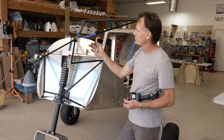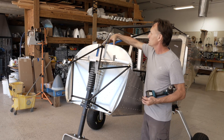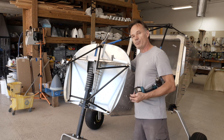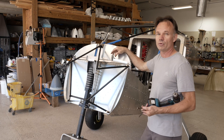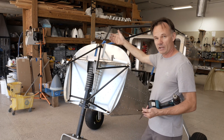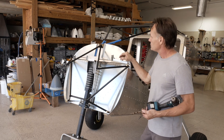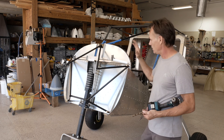Right now we just want to get all four, five, six bolts in there. Up on the top we have a handy welder's type clamp that fits nicely here so you can clamp it in place. When you do that, make sure the airframe is straight — moved into center on both sides — prior to clamping. Then work your way up: start with an eighth-inch drill bit, center it so you're sure to hit the pad on the backside for even edge distance. Work it up with three-sixteenths and eventually a quarter-inch. Bolt one side in, remove the clamp, then work the opposite side. Use brand new fresh drill bits — it's really hard 4130 steel and you have two plates to go through.